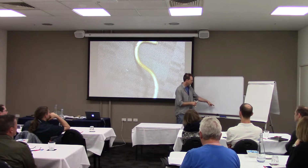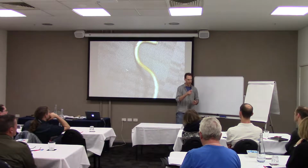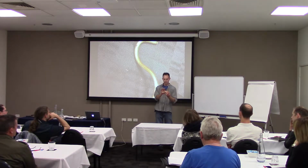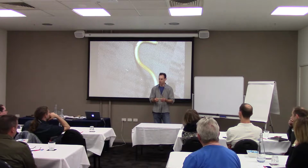Now, calculating this bend, you have to sit and duplicate it on both sides a little bit. So your layout is the longest time. But once you cut it, you make this a tube. It's already got your taper. You don't even have to make a mandrel for it. You can just do it on anything straight. And again, you braze it back to this point. Then you bring up this edge and round it out as you can. Then you can braze both of those sides, and then you've got a bent tube to work with.